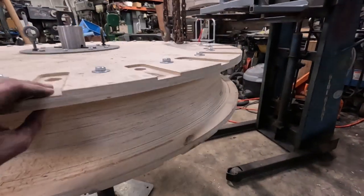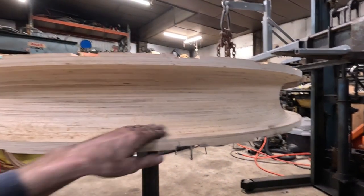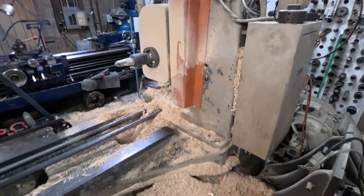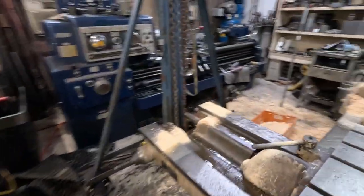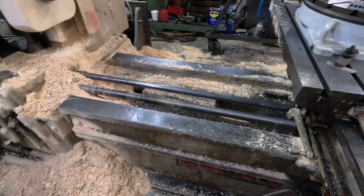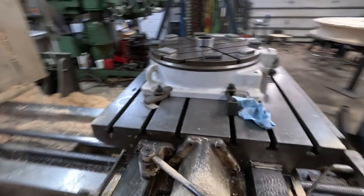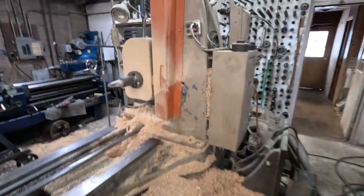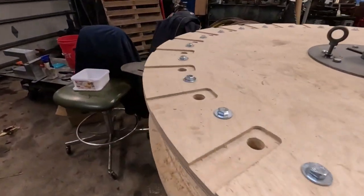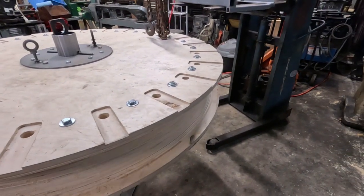There she is — getting ready to go deliver this thing to the customer. Going to knock some of the sawdust off and let them have the part back. But get a load of this — we've got a serious mess to clean up. I'm thinking what we're probably going to do, since there's oil left on the machine that the sawdust sticks to, is just start scrubbing the whole machine down with the sawdust itself, soaking the oil up until the whole machine is dried off enough to vacuum up the residue, then start re-oiling the entire machine from scratch. Thankfully the wood itself won't hurt the machine — it just makes a mess and turns into glue, so it's got to get taken off. Anyway, there she be — we're going to get her hauled off, dropped off, and we'll see you guys on the next video.